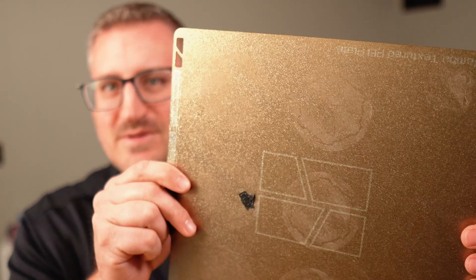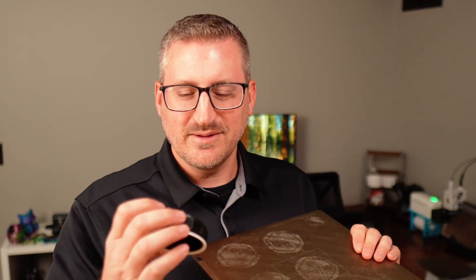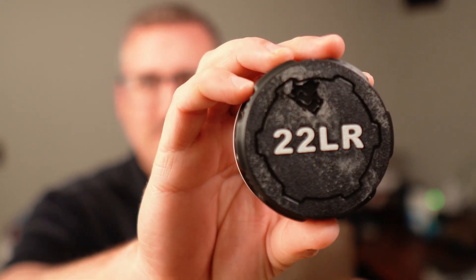This might be a plate that's dedicated to this model now. On the other side, I listened to your comments and started putting glue on the build plate and changed the bed temperature. It was defaulting to 80°C, but Polymaker's spool says 70 to 80 degrees, so I changed it down to 70 and put a layer of glue on — and actually this turned out worse than not using any of that. It ghosted just as bad and it ruined an entire ammo container lid. It just ripped right off the plate, so that unfortunately is trash.